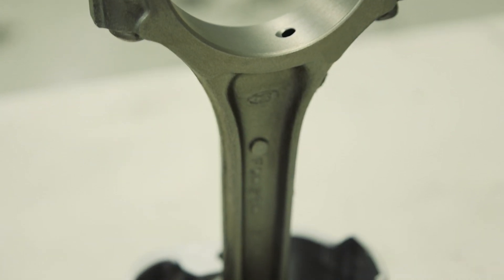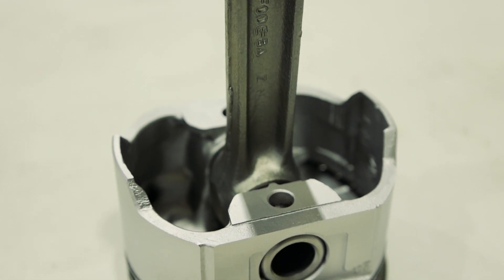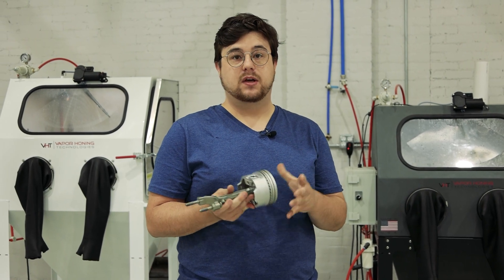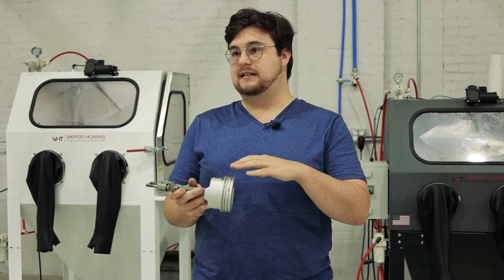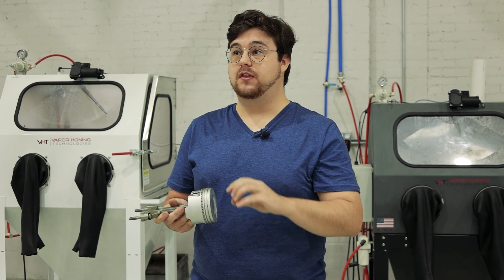Used aluminum oxide — it was like a 120 aluminum oxide. Did an incredible job at stripping off the corrosion, the carbon buildup, anything that was inside here. It did a great job at stripping off all the contaminants. And then after that, I wanted to get sort of a polish and clean finish, so we went to the VH 800 fully loaded with a glass bead and polished it up. After that, I did a little bit of burnishing — went from 100 psi where I started, then went all the way down to pump pressure to give this nice, polished, pristine look.